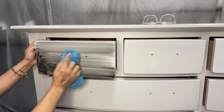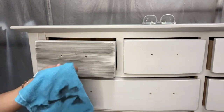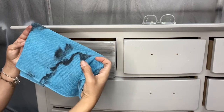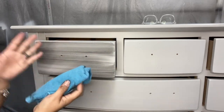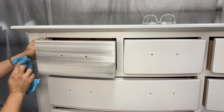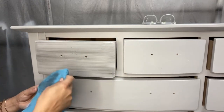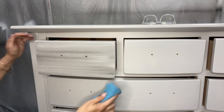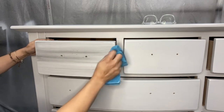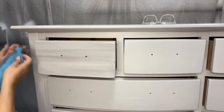I'm using the microfiber cloth folded into fourths, and I use each of those quadrants to remove some of the glaze a little at a time. You want to wipe and then move on to a clean side of the cloth to keep wiping. Continue the pattern you want to create — in this case I'm going straight from right to left or left to right in a straight horizontal pattern, because the drawer fronts are flat and this is a horizontal dresser, so I want it all to look the same way.